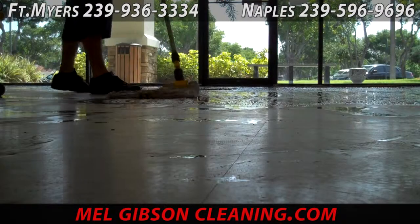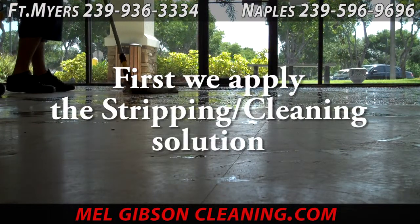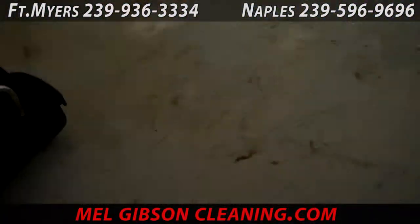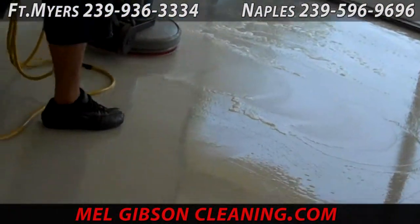You see here the new tile actually has pores — little pockets built into the vinyl tile — that will hold on to the floor finish as it's applied. Those little pockets are full of dirt, paraffin coating, glue, and general dirt from installation.